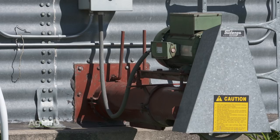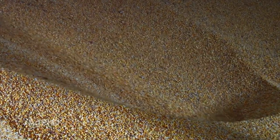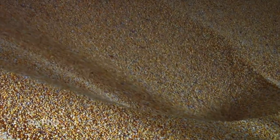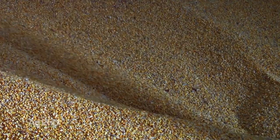By risk, what we're talking about is the farmer can then sink down just like quicksand in that grain and get pulled down toward that auger. So not that the farmer is going to necessarily go in the auger, but just that the farmer is going to go below the level of the grain, so he's completely covered by the grain, and now he suffocates. So what farmers will do as they get into these bins is they've got body harnesses and ropes.